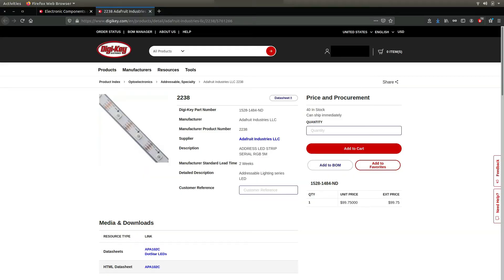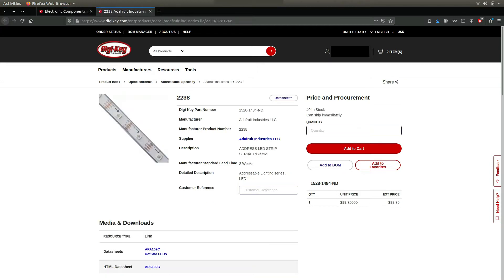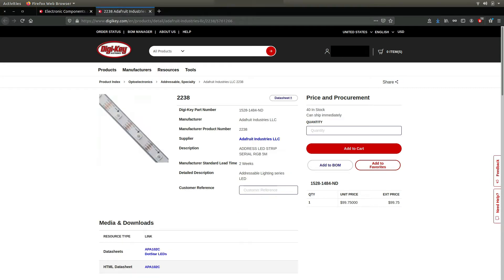For simplicity, I knew I wanted to use addressable RGB LEDs. Generally these come in two flavors: NeoPixel and DotStar. NeoPixels are a little cheaper and only need one wire for communication, however the communication protocol is very computationally expensive. DotStar on the other hand costs a little more and needs two wires for communication, but you can use the SPI port — available on almost any microcontroller — to make communication simple and easy. While I have used NeoPixels in the past, for this project I chose DotStar.